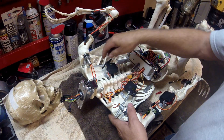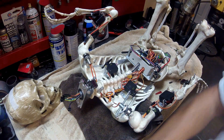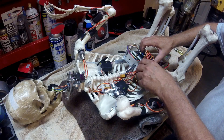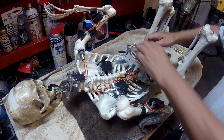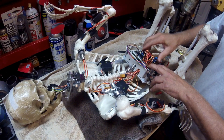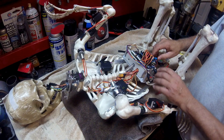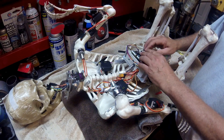Most of the bracketry I made out of aluminum stock — threaded a lot of stuff. Skelly's powered by the control box, an Arduino Mega, and I have the PS2 shield underneath this shield, which I modified — I cut the power supply out from the control board and ran an individual power to my servos.